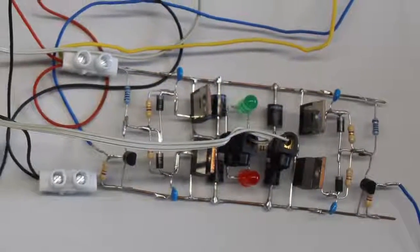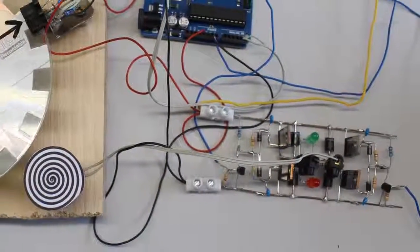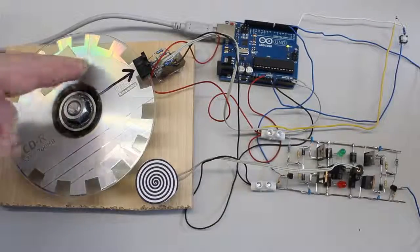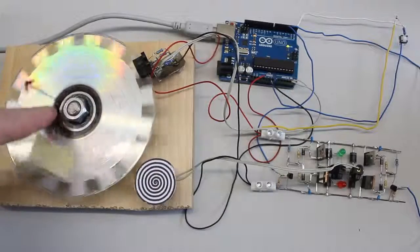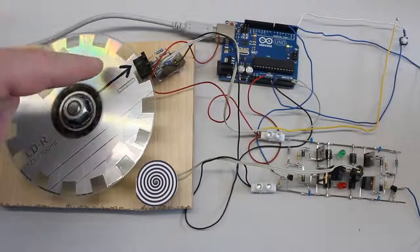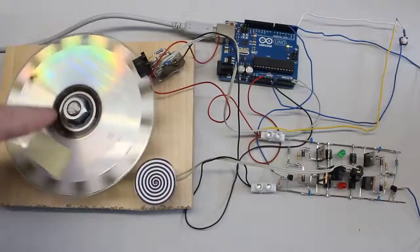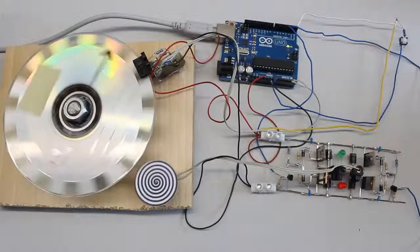Two output pins can be used to control an H-bridge. The working principle of those circuits was treated in a previous video. Using an H-bridge, the polarity of an electric motor can be swapped. If the sensor disk is rotating clockwise, the electric motor is spinning in the same direction. Contrary rotation of the sensor disk causes a counterclockwise rotation of the motor. The microcontroller can swap the rotational direction after pushing a button. By pulse width modulation, the rotational speed of the motor is increasing whenever the sensor disk speeds up too.